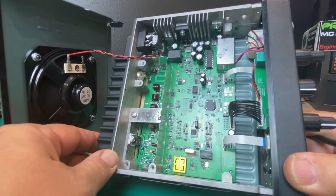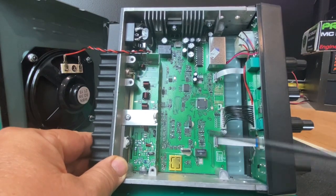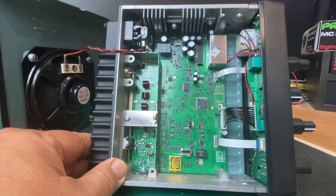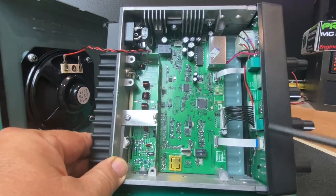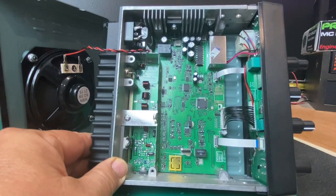It's just a single final unit — a really super clean radio. Another cool thing: no more golden screwdrivers. Everybody wants to get their CB radios tuned up at truck stops, but in the wrong hands that work can give you a distorted-sounding radio. What they do with these now is use the front panel menus to get inside. This has a special service mode where you press certain buttons at a certain time in a certain way — I'll show you that in a later video. That's how you adjust the modulation. No more screwdriver mistakes messing up your radio.